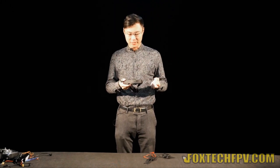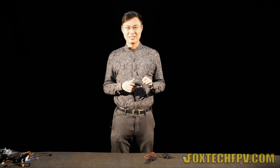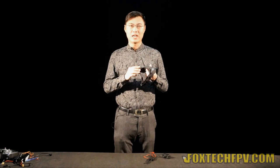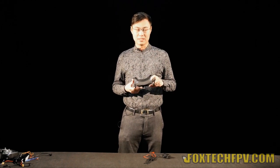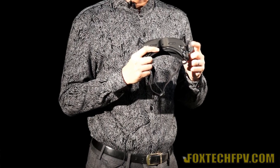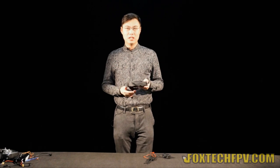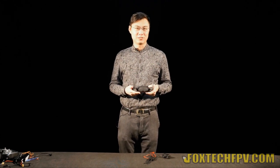Another great point about these FPV goggles is that we actually added a recorder inside. This is new, because at the beginning when we flew FPV, we needed FPV goggles, a receiver, a ground recording device — something big. Now they are all integrated into this single small FPV goggle. When you fly FPV and want to record the whole video, just press this button, and the whole video received by the two antennas will be recorded to a small micro SD card right here. Although we can take HD video on board, we also need OSD data recorded, so you don't need an extra recorder anymore.